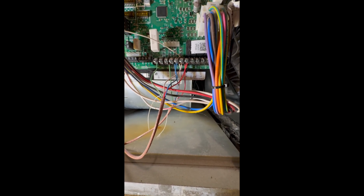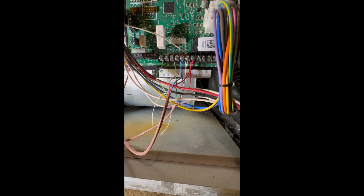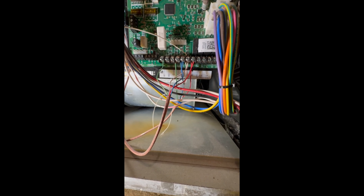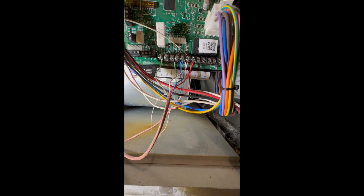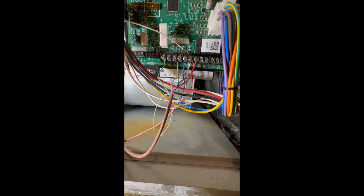And then R is essentially the load — that brings power from the system. Anyway, I had to do a little bit of trial and error, but it wasn't too complicated, because all we really need is heating and cooling. We don't need anything fancy, we don't need a secondary heating or cooling system — which would be Y2 and W2 — and we don't need the fan hooked up. This is the orientation I used, and it worked great.